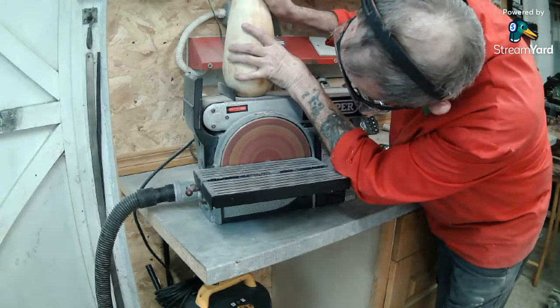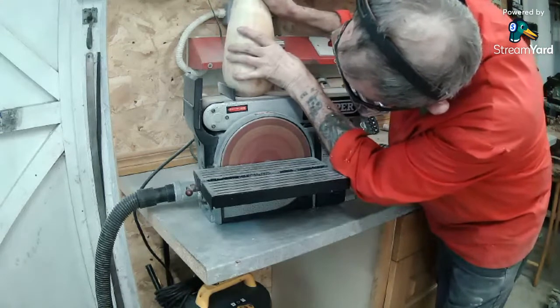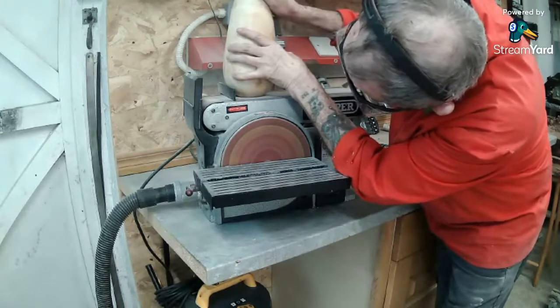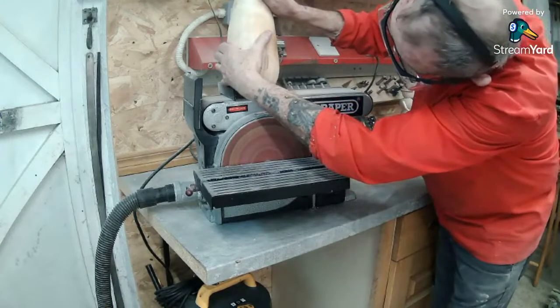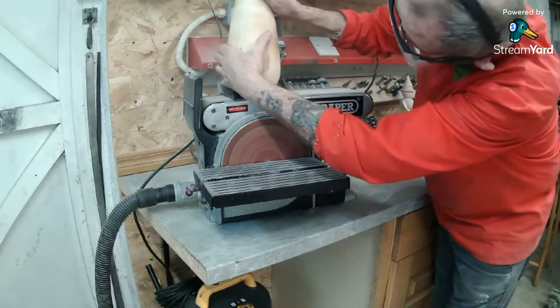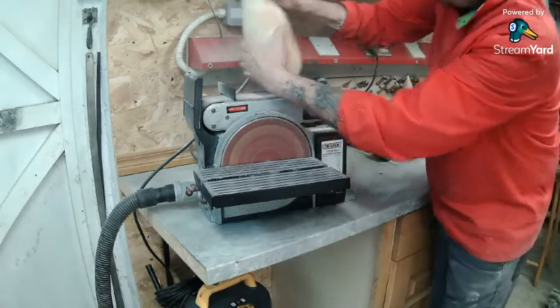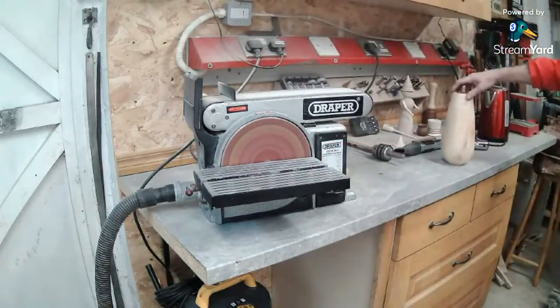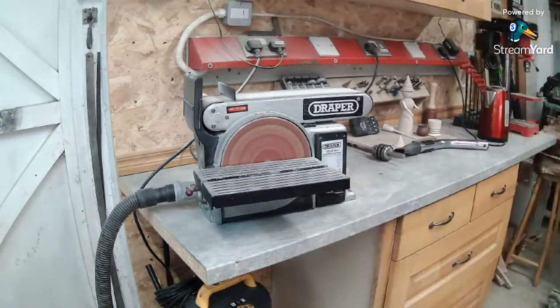Turners, if you haven't got a belt sander handy, you can always make a disc and stick it on the lathe. Yeah, I use a disc on the lathe. Well, I use a sanding arbor on the lathe, actually. That way you can get a bit of a concave bit as well. It should be better now, I think. Michael Buckingham is suggesting you could just colour the rim on the inside down to the end of the cracks. I suppose you could, but if the cracks are not fully filled, the colour would come through to the front.